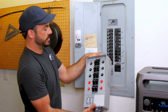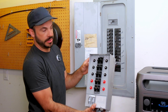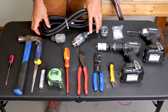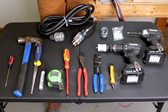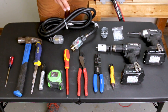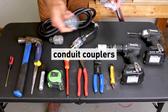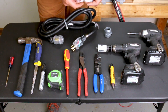That's why we selected this model — we have six 120 volt circuits on top and two 240 volt circuits below. For additional materials, you'll want an appropriately sized cable with the correct ends for connecting the Solex F3800 to the inlet on your transfer switch — ours came with the transfer switch. You'll also want any conduit couplers required and the appropriate anchors for attaching the transfer switch to the wall.